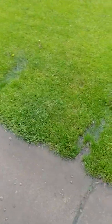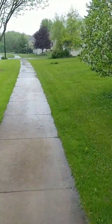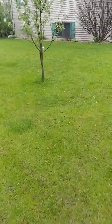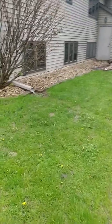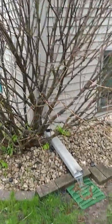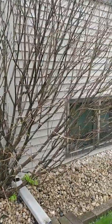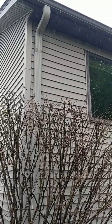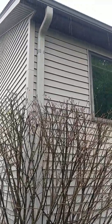There are two more sidewalk trenches — it drains out pretty quick though. I've got two more downspouts to cover and then we'll go down to the lower garage where I haven't started too much yet. The lower garage is where I'm going to rent a mini skid steer and an excavator and do the French Drain Man treatment. I upgraded all the downspouts to four-by-three five years ago during drainage phase one — the original holes barely bigger than my thumb, so they always clogged. I made them full three-by-four.